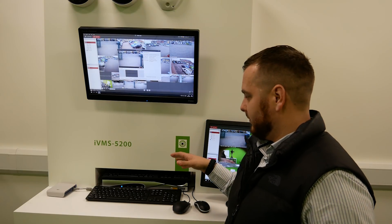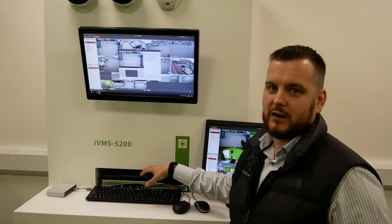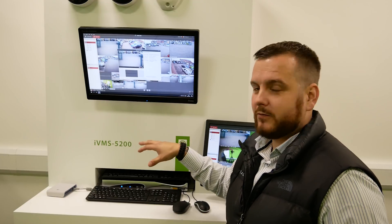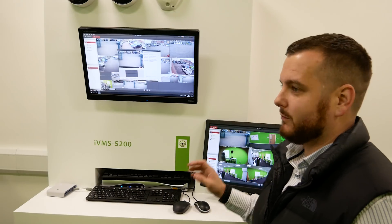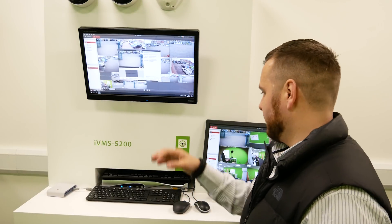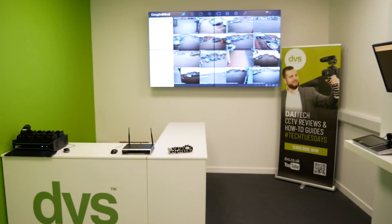It's fantastic for the cost — pre-installed, nice and thin, already set up, very simple. Just be mindful of performance if you're going to put 64 cameras on screen at the same time; throttle your sub-stream back, or just be sensible and use one monitor. But it does support two, and for the value it's a very nice bit of kit.